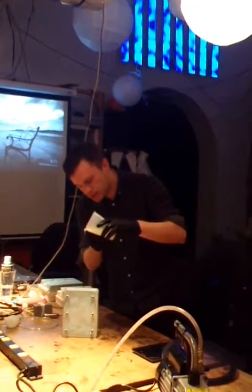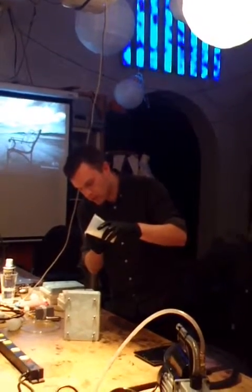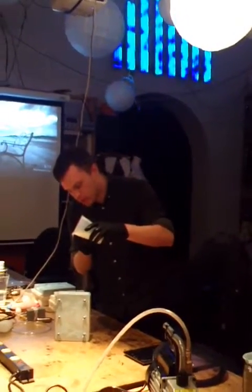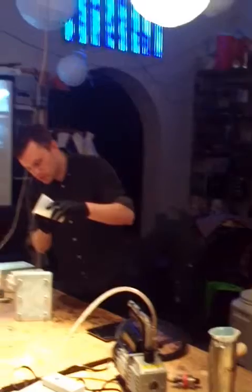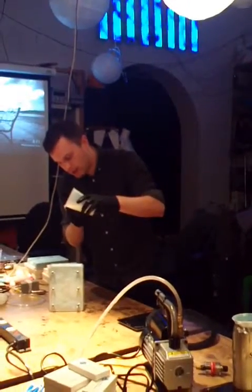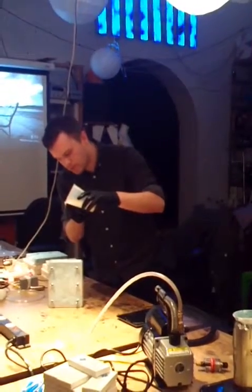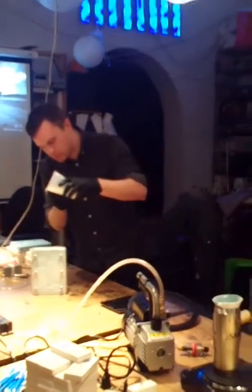And so pretty much I just do this process until the mold drinks up all of this silicone. You can jiggle the mold around a little bit to get rid of any air bubbles. Rather than do that, I vacuum degas it, but jiggling it, tapping it, there are these things called vibratory tables, which just do the job of jiggling for you.